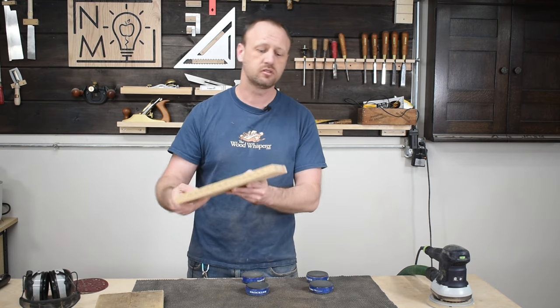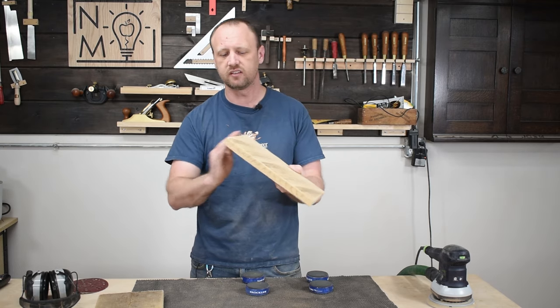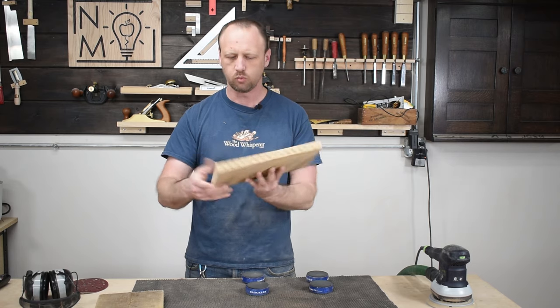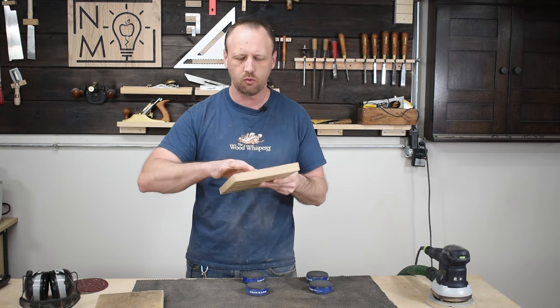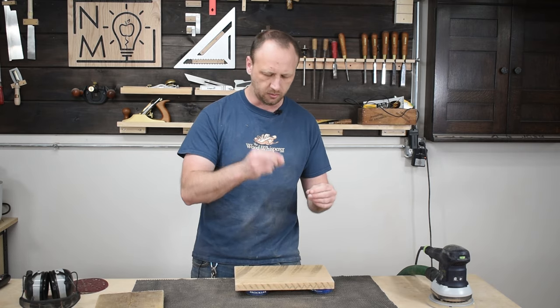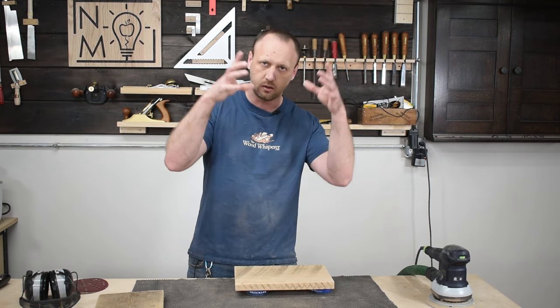I'm gonna head over to the table saw. I'm gonna buzz the ends off to get those nice and clean, because before I just hit it with a jigsaw. And there is one crack right here that I wanna fill with some CA glue. And then we can start working on putting the pole in here, or the stick in here, that will hold the hat.